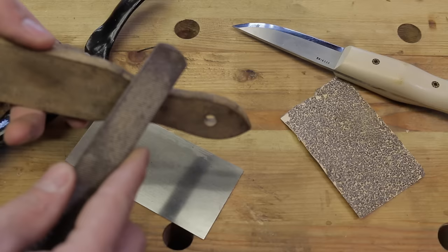Make sure your axe is really clamped in there — you don't want it moving around. If you have a sheath it wouldn't be a bad idea to put it on to protect yourself from the edge. This edge isn't particularly super sharp so I'm not too worried, but if you don't have a sheath you can just put some duct tape over it. This is why I like to do the handles first and then the edge — to limit our exposure to it. Using the card scraper, we'll go across at an angle, and you can see that starting to pull the varnish off nicely.